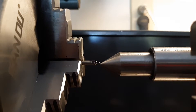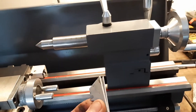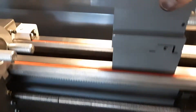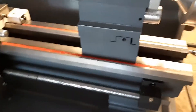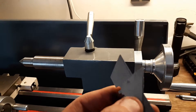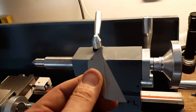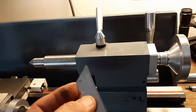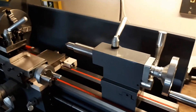I'm 40 thousandths off, and I tried shimming up the tail stock front and rear. I just used what I had on hand — I used some straight razors from a box cutter, put those in front and rear. These might add up to a total of 45 thousandths; they weren't exactly 20 thousandths each — one was 20, the other was 25 — so I can mix and match, but I went with 45 and 45 front and rear.